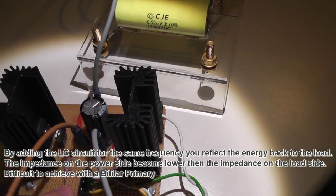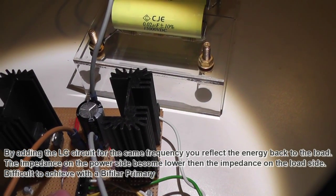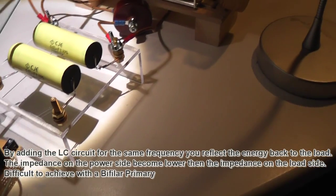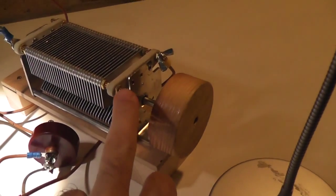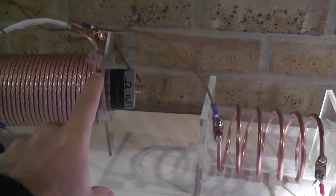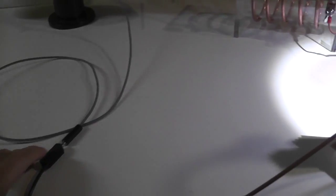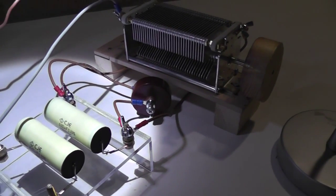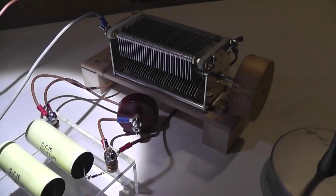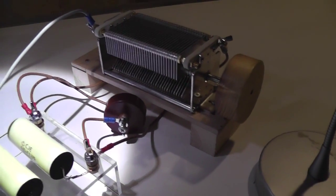Adding a matching LC series tank which reflects your frequency on your primary-secondary for the load. So here I use a capacitor — a couple in parallel — and this one for fine adjustment on the side, connected to an inductor, which then connects to your load on one side, and the other side goes out to the common of your power supply. On my tutorial web page you have the link to the frequency calculation — very simple. The main frequency here is between 750 and 800 kilocycles. I measure the inductance — it is 1.6 microhenry — so that means I need 25 nanofarad here to give me this kind of frequency.